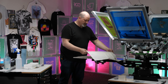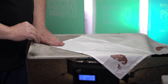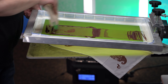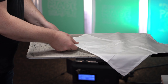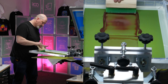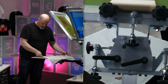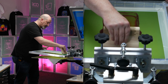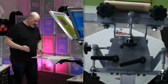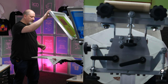Definitely coming in contact with the adhesive on the platen. Stitching's off on this corner a little bit. Now one of the things I've noticed is because of this texture we've got here, we've got a little bit of residual ink in the image that doesn't clear all the way. And that can leave a little mark when that next screen deposits ink — we've got a little bit of a jagged pattern happening. That'll leave a little bit of ink in the screen, so when that finally drops, you can have a slight bumpiness to the edge of your print.